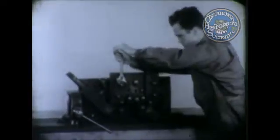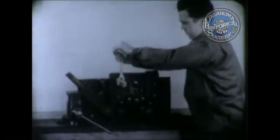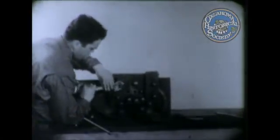Hold it, Dokes. You're pushing against the movable jaw again. Turn the wrench over. That's better, but tighten it snugly against the nut. And Dokes, pull, don't push. Of course, adjustable wrenches can be used in both directions when the work to be done is light. But it is well to remember that they do their best work, develop their greatest strength, and are safest to use when you pull on the same side of the wrench that carries the fixed jaw.